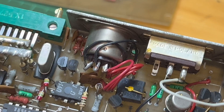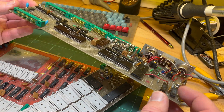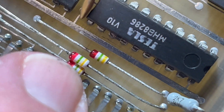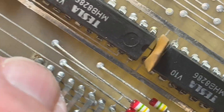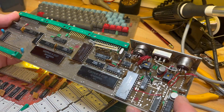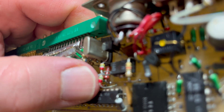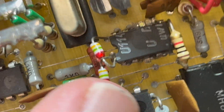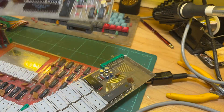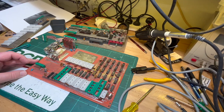This is the expansion bus at the back. I'm not too happy with things like these - I think the resistor network is pretty cool but these components here, I'm not sure if they're diodes or something, but you can see how the bare wires are just so close to shorting out. Maybe once it's in the machine and not being touched it doesn't matter. Although actually they are connected together there so it doesn't matter that they touch. That's the expansion port at the back, which plugs into the main board here.